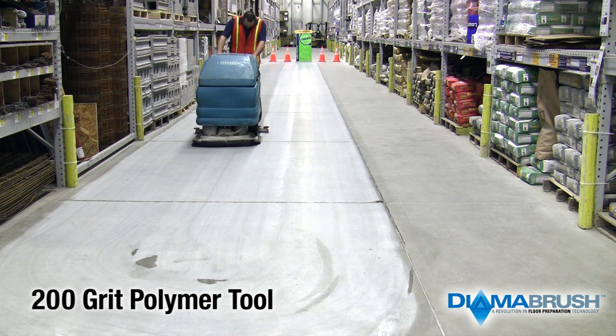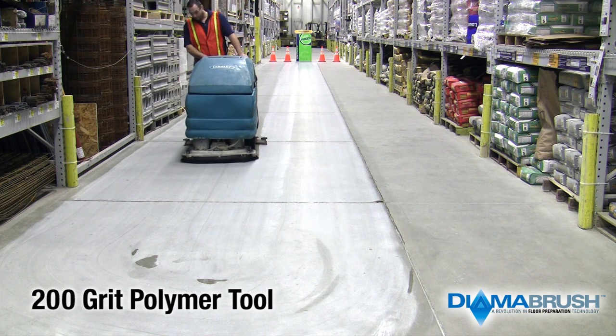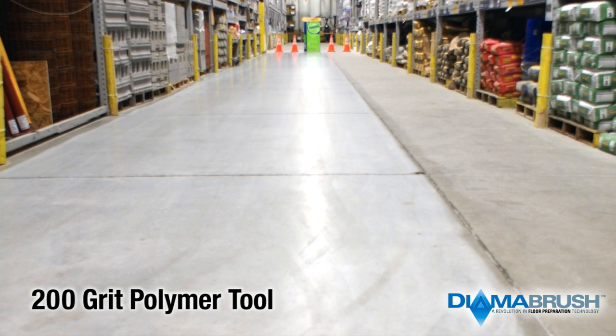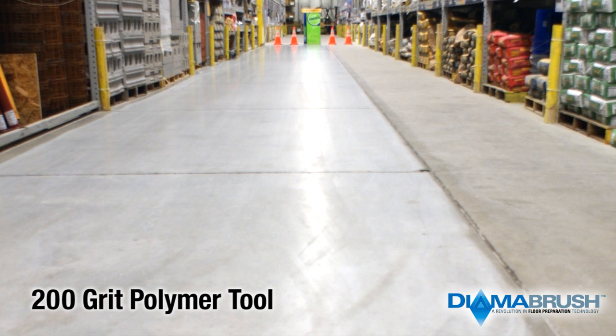You will need to make approximately 6 to 8 slow passes with the 200 grit polymer tool, making sure you are covering the entire area being polished. We've just completed 6 passes with the 200 grit polymer tool. The floor should start to take on a matte finish and will start to feel very smooth to the touch.